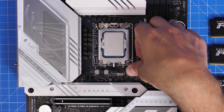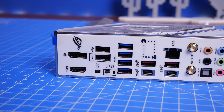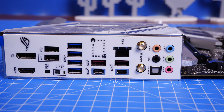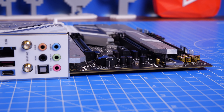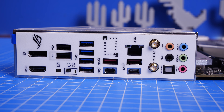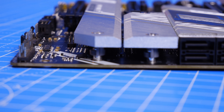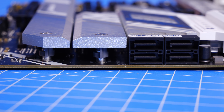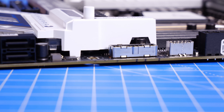There are a lot of ports on the back — all specs are in the description — but you'll see it has two USB-C ports, multiple USB-A ports, and you can also connect USB-C on the front panel. There's also a BIOS FlashBack button, which is really handy: put your BIOS on a USB stick, insert it, and update with a single press. One downside is it only has four SATA ports, so you can only connect up to four hard drives or SSDs, which is the least I've ever seen on a motherboard.